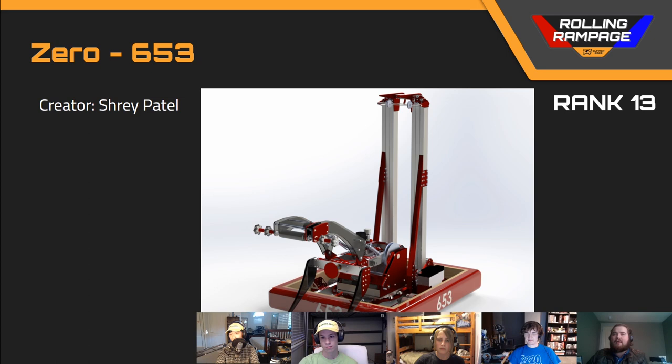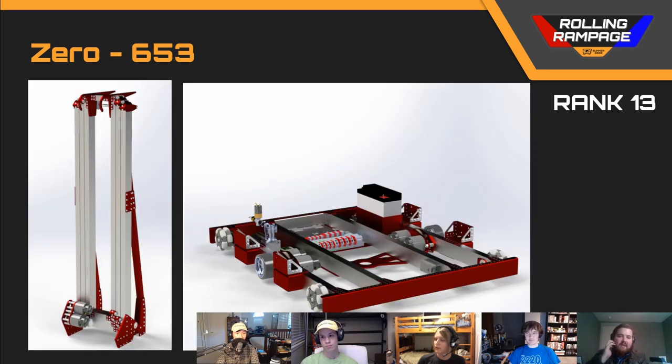I really do think this claw was a little bit small. I don't know the effectiveness of such tiny mecanum wheels on these large balls that have a cloth outer skin. The teams that did manage to use mecanums in 2014 had decent success using the 4-inch ones instead of the 2-inch. I did really like the polycarbonate plates for the claw itself — very robust — and it was missing a couple of little details here and there, but I think reasonable.